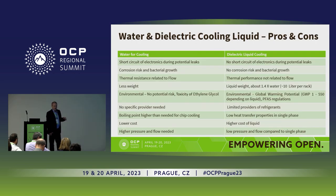We spent quite a lot of time working on pros and cons for each one of the systems to help select the right one. With dielectric liquids, there is no short circuit even if liquid leaks or somehow gets to the electronics. Another benefit: you do not have corrosion with these dielectric liquids, and there's no risk of biological growth.